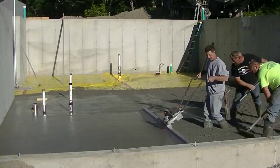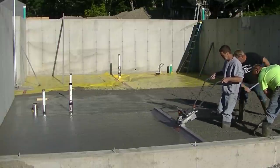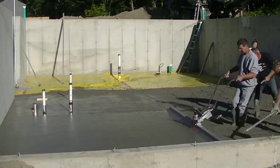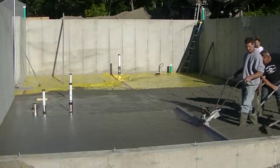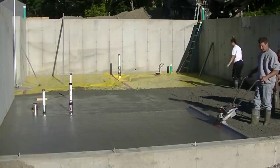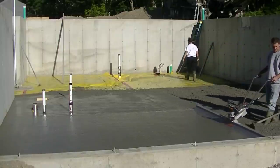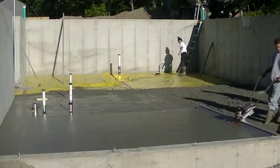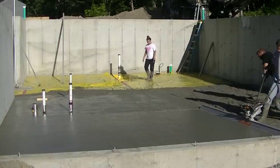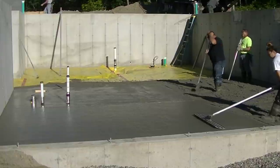That's the line you want to be looking for. This bay right here has a twelve-foot board on that screed, so I'm screeding about a sixteen-foot section — twelve by sixteen. That took me just about a minute and a half, about ninety seconds to screed that. And again look at the amount of effort I'm putting into it — I'm not even breaking a sweat. So the power screed really is a simple way to screed concrete, especially if you've never done it before. The thing just floats right on the surface pretty much, and your job is to pull back on it.